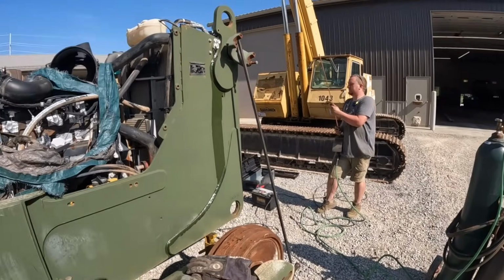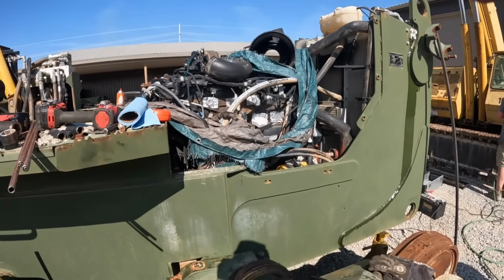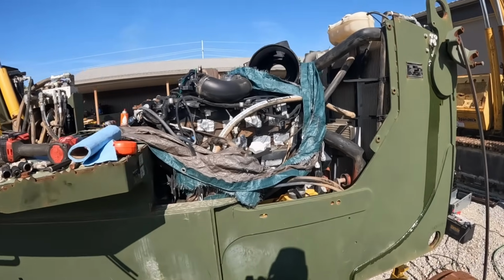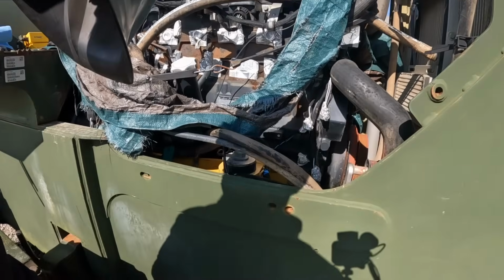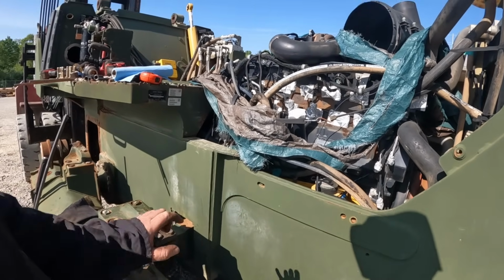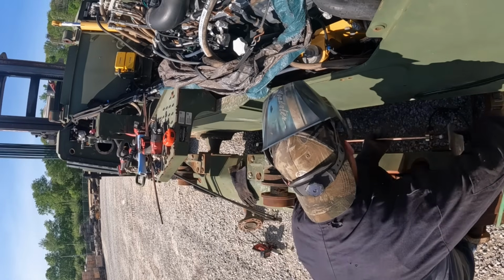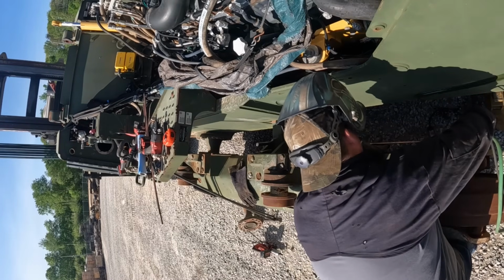Kevin's going to get the stick in there. I'm going to set you guys up. I hope I don't melt you down. And we'll get her bored out. We're going to do the other side too, because it's stuck. So when we blow a hole through the center of that, that's actually going to relieve some pressure, and that pin will shrink a little bit, and then we should be able to knock it out. No camera burn down. It's all for the people.